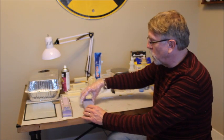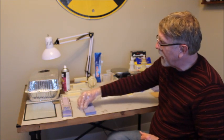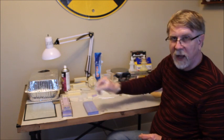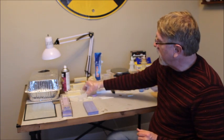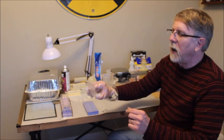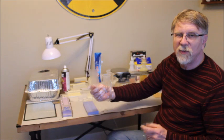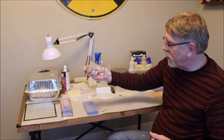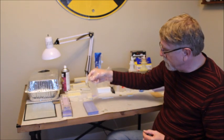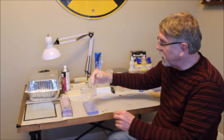With a flat mold, once you get all the resin in and you get the bubbles chased out, you want the back of the flat mold to be as absolutely flat as possible. In order to do that, what I've done is I've taken some pieces of plastic that are intended for glazing. They're like a plexiglass used for storm windows and that type of thing. You can buy them at a big box store. And I spray it with the mold release because I don't want the resin to stick to it.